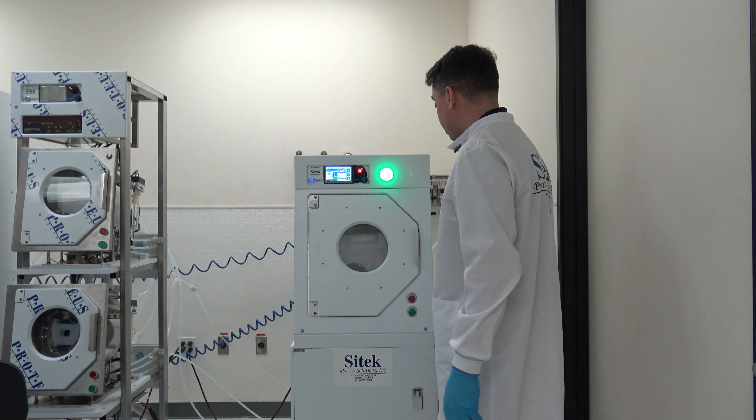When we have a normal spinner rinse dryer process, as you see here, you will see absolutely no water spotting or any other type of surface contamination associated with the wafers. That's obviously the most important part — to keep your product in a condition ready to continue your production process.